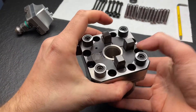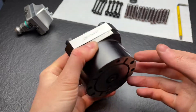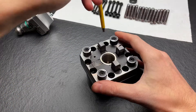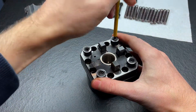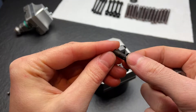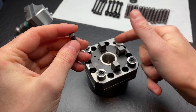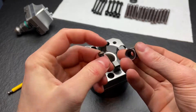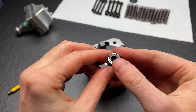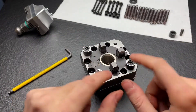I think it will work even if one is missing. It is pneumatically actuated — you have the chuck, and on the bottom there is a little hole. Through this hole, if you actuate it with six bars of pressure, the system is released. Starting from the top, there is a very nice detail with these Z-height stops. The screws have a hole in them, and near the top there is a through hole, so air moves through and is pushed out through the hole. On these studs there is also a hole which ends on top, so it can blow chips off and any debris — giving you a nice contact surface when you clamp down.